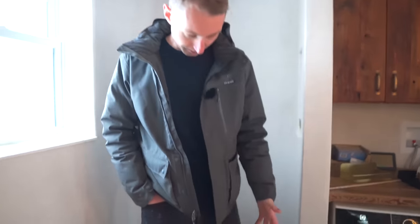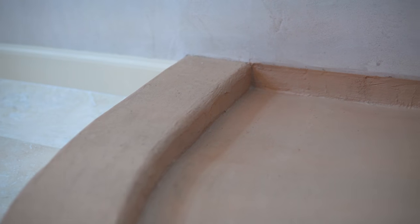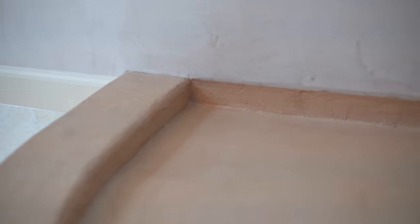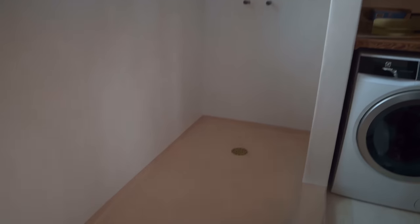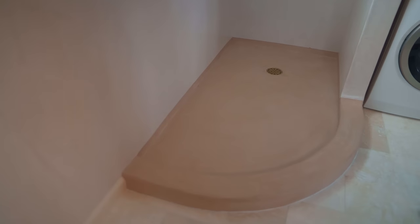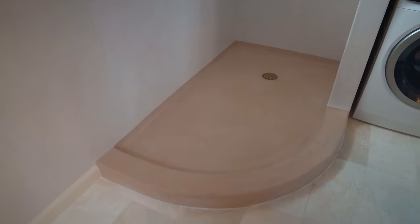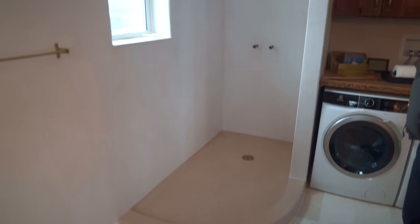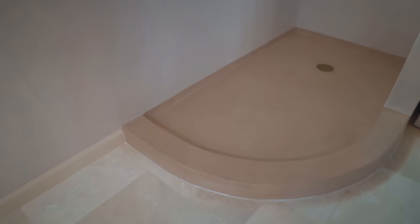And then the floor is a micro cement. So it's basically a micro cement topping. It's a really thin cement that you trowel on, and then you protect it and make it waterproof with an epoxy layer on top. I think it's kind of traditional that some folks would carry on the same color, but we actually dyed the micro cement a little bit darker, and we liked the effect it created of a bicolor, as if it was dip dyed. We used the same exact color as we used on the wall, but obviously a much thicker concentration.